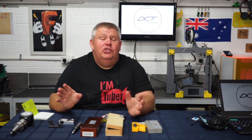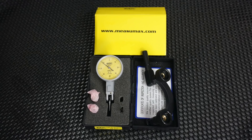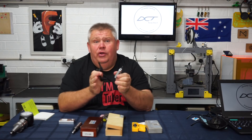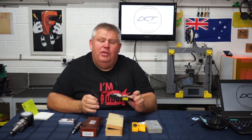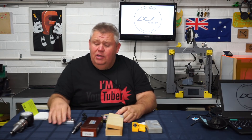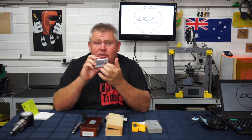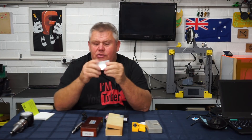Another little finder I bought that I wanted to show you today — I couldn't, because the holder I bought from a tool vendor in Brisbane won't fit it. I explicitly stated I'd like to use this to sweep it into a bore to clock in a bore and get it spot on. Unfortunately, the arm they sent me doesn't match. With a finger dial gauge like that, it's quite easy to get in and probe your bore to pick up your work coordinate — the X and Y. But you can do that with an edge finder and your digital controller pretty much just as easily.